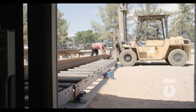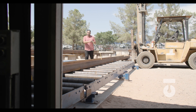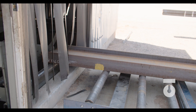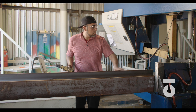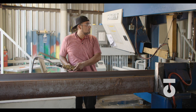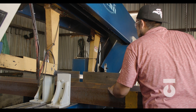You will want to use discretion to check and triple-check drop and lengths. Using your measuring tape, soapstone, and square, you will etch thin clean lines to account for the first inch of drop to be cut on our steel, so we have a clean and square end. Your beam will most likely lay with the web of the beam flat, the cut being perfectly perpendicular to the direction of the steel, thus giving us a square end to measure the beam to final length. Make sure the angle and the direction of your bandsaw is oriented correctly for a square, clean cut — and then cut.